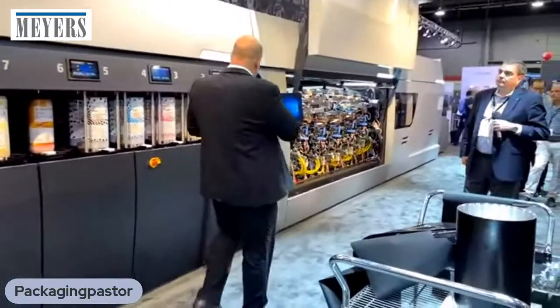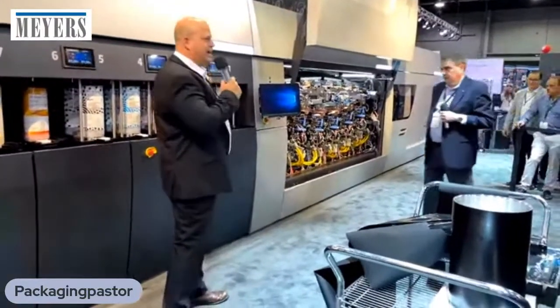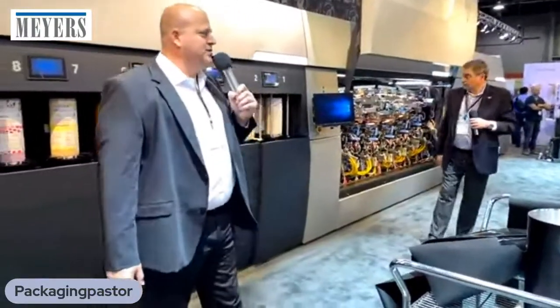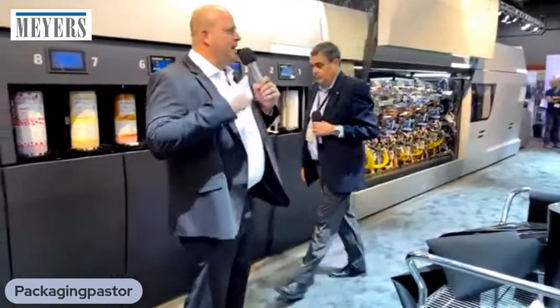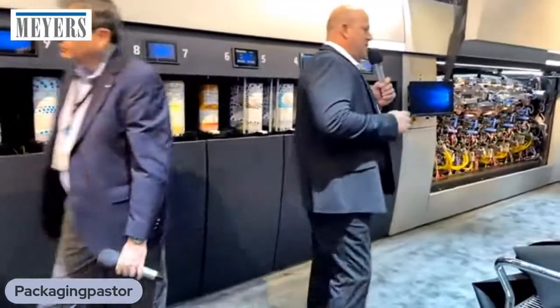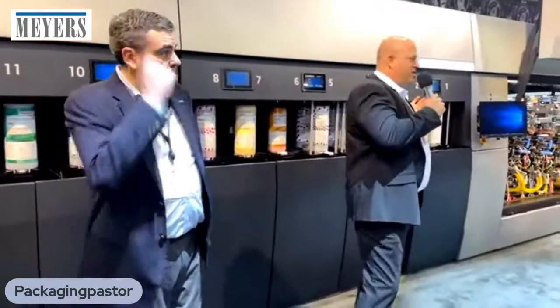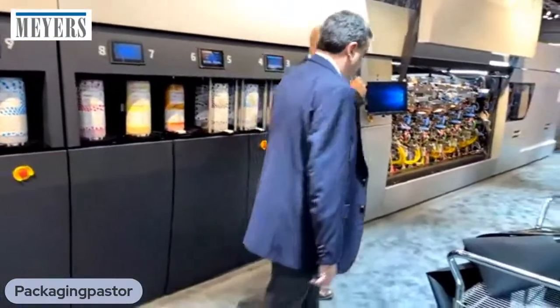And in addition, you can see a mechanism we call revolver. You see the tank here in the front and the tank in the back. Printing at the speed of 400 feet per minute will make your ink tanks run out of ink very fast. We would like to reduce the operator attention, giving time to react. So the press will automatically identify when it's run out of ink. The revolver will switch to a fresh tank. You will get a visible notification on the screen.